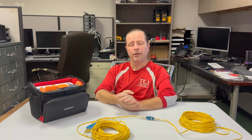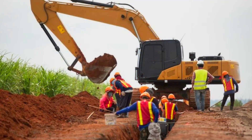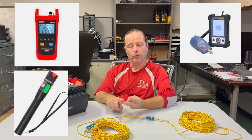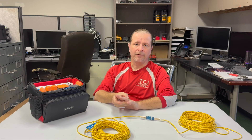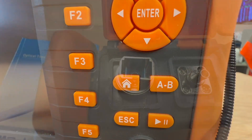You're not going to easily be able to tell that on a handheld one like this. Even if you print it out, you have to meticulously go over the graph to determine total loss along the line and whether it was appropriate for any particular application — much too difficult to do manually. Use the certifier for that. For everything else, this is good for when you just need to know where the break is — did a guy with a backhoe cut your line, and if he dug in more than one place, where did he hit you? This is an optional tool. Far more important are a light meter, microscope, face inspection, and visual fault locator. Those are your three main things as someone boots on the ground. It's nice to have, so consider it if your budget allows. I'm Derek from Tech Connection — thanks for watching, see you in the next one.